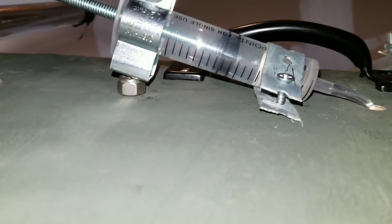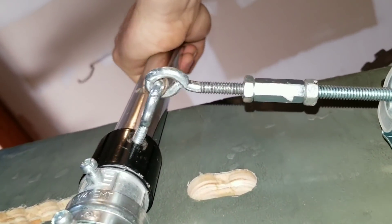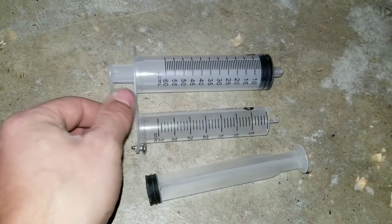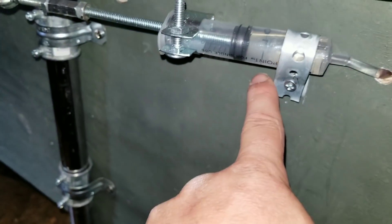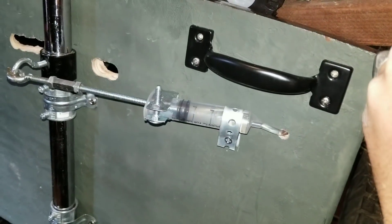Here's what's going on. This guy's at kind of an angle, and then as it turns, the angle keeps everything in line. There are a couple cool things you can mess with if you do this system. One is different sizes of syringes — basically like a gear ratio, but it's a fluid ratio. On mine, for example, I have a 20 milliliter here and a 35 here, so it takes less turning of this to do more movement there.